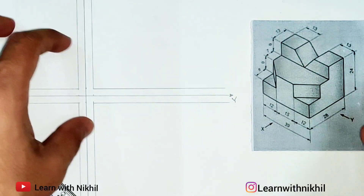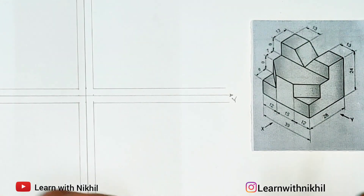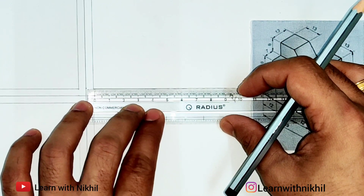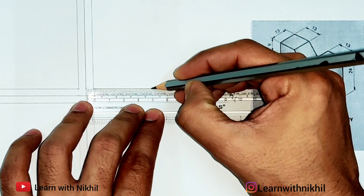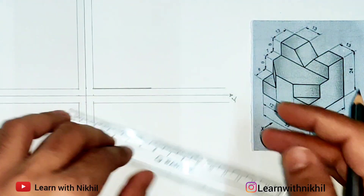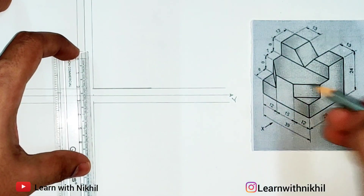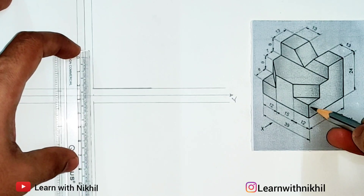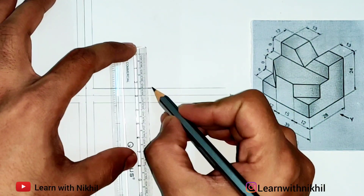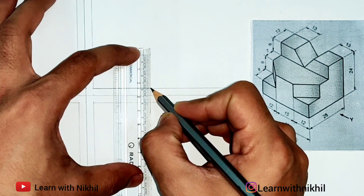These are the baselines. Now let's begin with the sum — first we will start with the front view, X direction. As you can see, there is a straight dark line of 39 millimeters — this is the total width of 39 millimeters. From the base we will draw this dark line of 39 millimeters. Then we have a straight perpendicular line — the distance is not given directly so we can calculate it from the top. The total height given is 24 millimeters, so from here 24 millimeters above I'll mark a point.